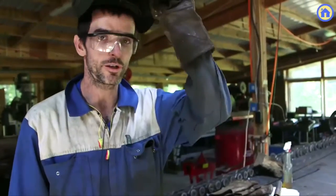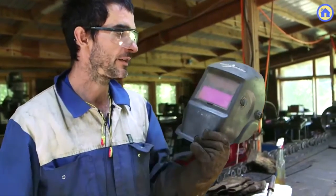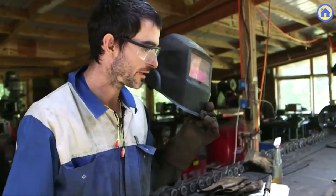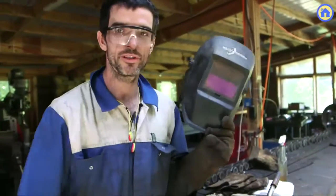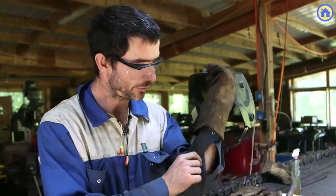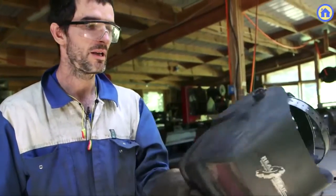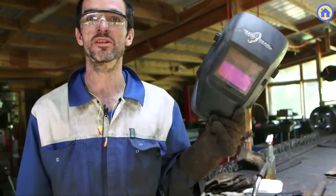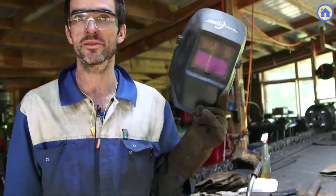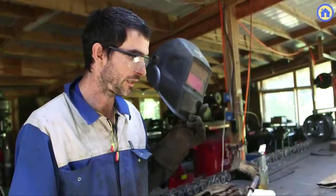For safety, first of all wear your welding helmet. We have self-darkening helmets which activate when the arc happens. The arc is an intense UV source and it will also burn your skin, so you want a long-sleeved shirt. There's spatter that comes off, so you want gloves for handling hot metal. Some people may not realize it while welding, but it's just like being on a beach — you can get a burn within minutes because the light coming out of the welder is so intense.